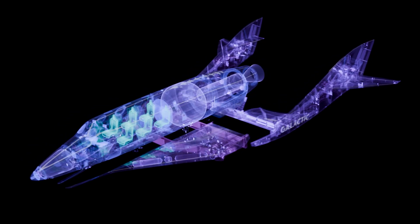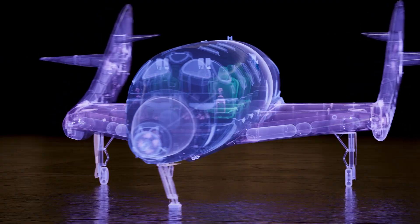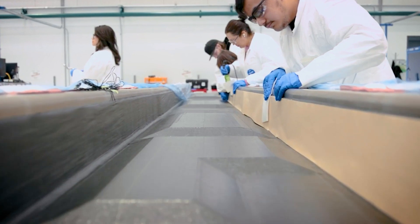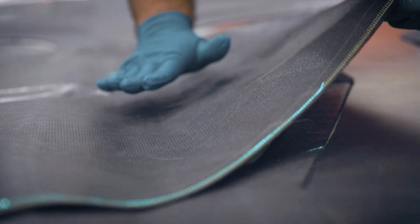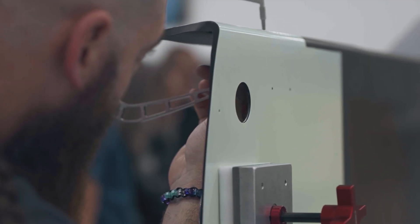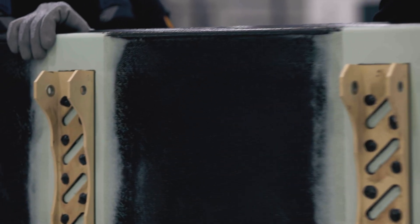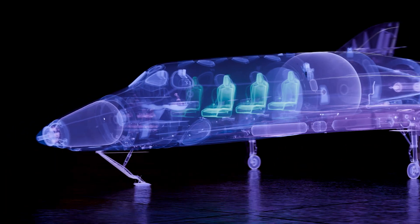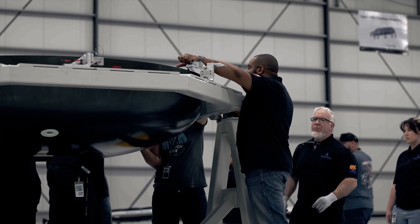We are utilizing and taking advantage of a digital thread across our facilities, partnering with Dassault Systèmes with our 3D Experience platform. It starts with ENOVIA, coming from our Orange County headquartered engineers — they are designing, modeling, and creating the ship from scratch, establishing the engineering definition of what is required to build the ship. Our manufacturing engineers then take it from there and build a manufacturing definition. Next up will be the process plans: what fasteners are required at the sub-assembly stage prior to the major assembly — that's what we call assembly level. Technicians are absorbing all this information, taking together all of the work instructions and assembling as required. It's very much streamlined through all the digital processes in 3DX. Now we know exactly where every part's going to go.